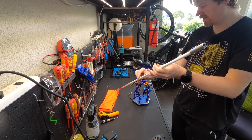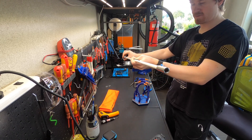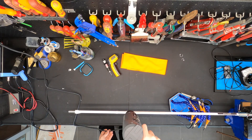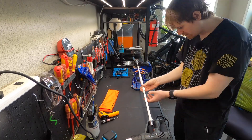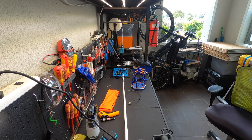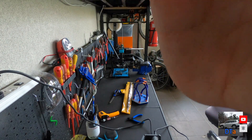The third piece is a little different because it only needs to be secured down to about halfway along, to allow this to run out and plug into the bull bar, since it goes all the way down to the bottom. For some strange reason the top camera overheated and stopped recording — maybe it has something to do with the maniac waving a heat gun around. While the antenna could be a better match, especially with more attention to getting the base capacitance right, in practice it works well and the V-SWR is less than 2 to 1. I'm going to call this a success — don't forget to like, comment and subscribe, and see you next time.